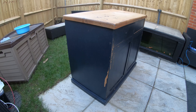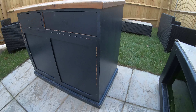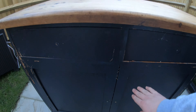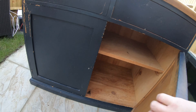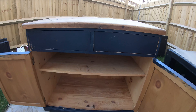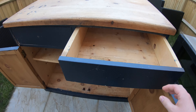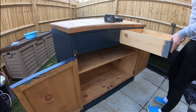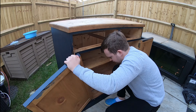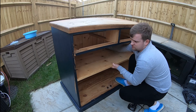Here is the brand new used cabinet. As you can see there are loads of scratches on it, loads of the old paint is peeling off and it is looking really tired and worn. The top has got some wax from a candle and is really scratched up as well. Inside there's just a single shelf resting in there. The cabinet itself is made of pine, with magnets to keep the doors in position and two drawers at the top. The first job was to remove the doors, the drawers, and the shelf so we have the bare carcass to start our work on.